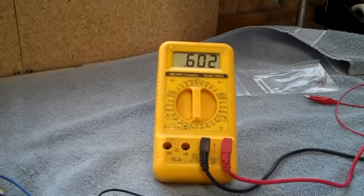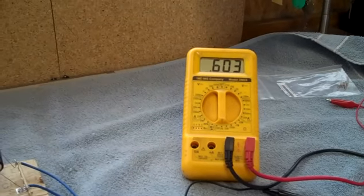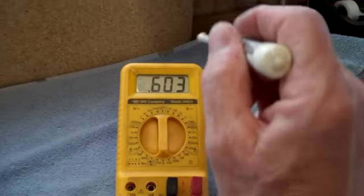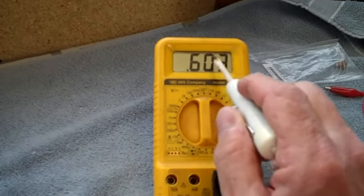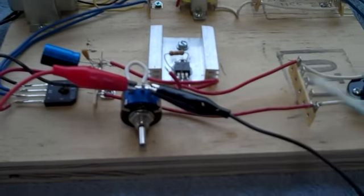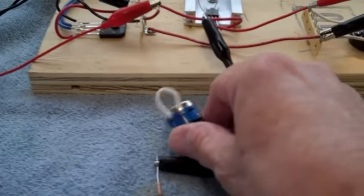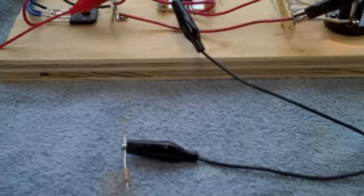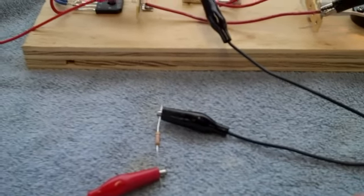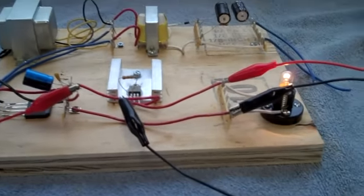What do we do now? We are going to take a 600 ohm resistor. We're going to go by what it's reading here — remember, out of the circuit is what we're actually going to go by. It went from 172 to 603, so we're going to stick a 600 ohm resistor in there. I'm going to put it in with gator wires and then turn this on and see what kind of voltage we get out. I've got the potentiometer removed and I have a 620 ohm resistor — that's all I had, I don't have a 600. I've got it across where the potentiometer was connected.